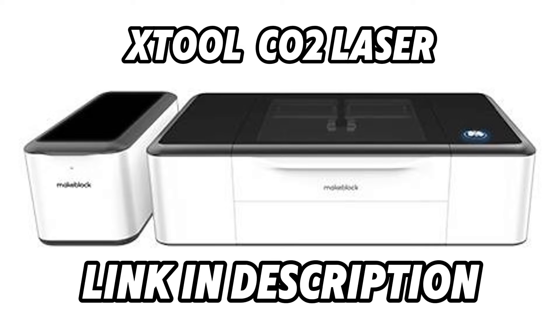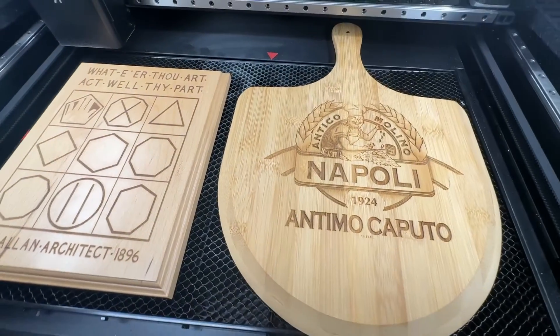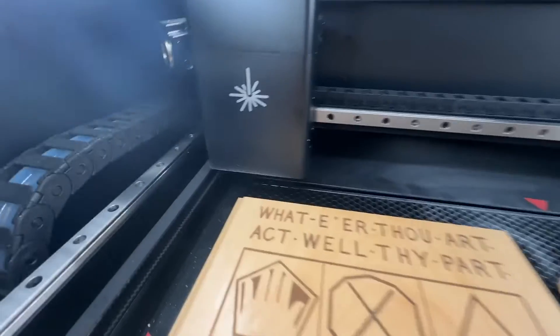There are different kinds of lasers. The one behind me here is a CO2 laser — it's a very common laser. This one's made by Xtool; I'll put a link in the description. With all lasers, wattage really indicates power. A 5 watt is low; this one's a 40 watt, that's decent power. This 40-watt CO2 laser is excellent at cutting wood, cutting acrylic, leather, even paper, and it can engrave too, though it takes a little more time versus a fiber laser. It handles a very broad spectrum of cutting and does an excellent job.